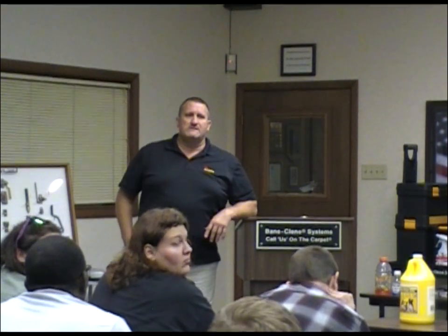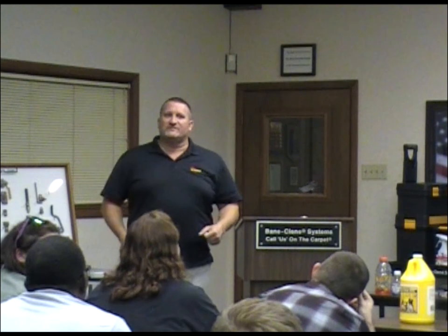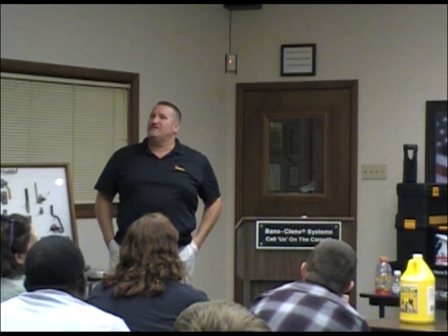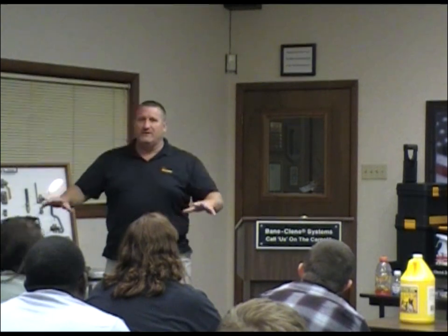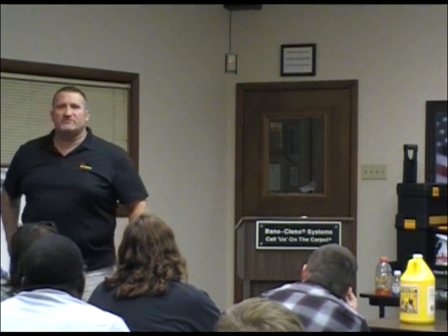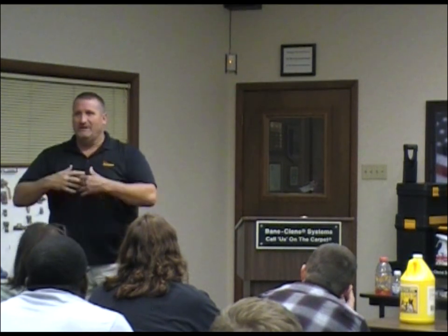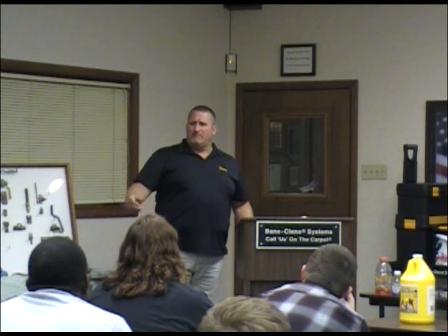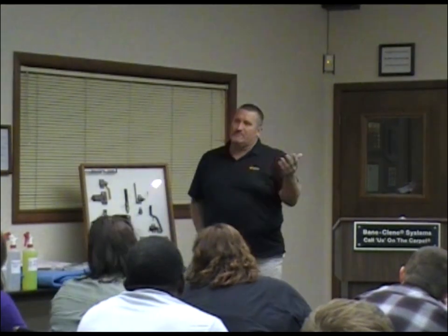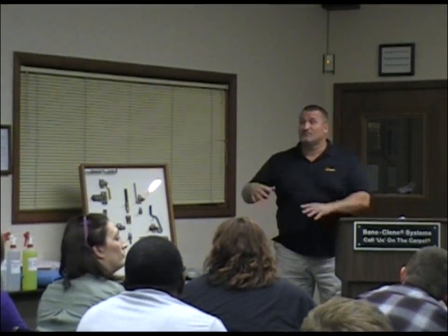So you said you still rinse the spots, you just don't get all of it out? Yeah, I rinse it just enough where I'm not leaving the carpet squishy. If you had to clean it aggressively because it's filthy, would you reapply the OS1? Before we walk out, we take our electric multi-sprayer and spray all the carpet, then take our grooming machine and groom over it — I want to brush it down. How long does it take to dry? It's not like I'm drenching; it's just an OS1 mist and we brush it into the fibers. I tell clients our carpet dries within four to six hours, but I tell people 24 hours to dry. I can leave it in the carpet; I don't have to flush it out.